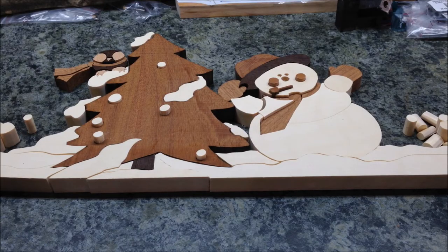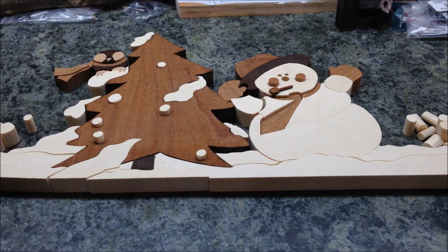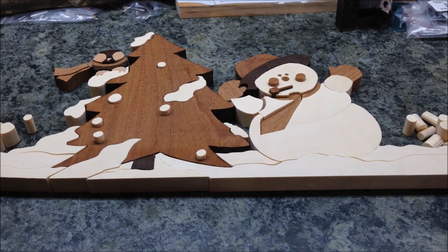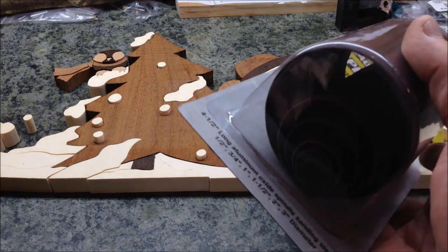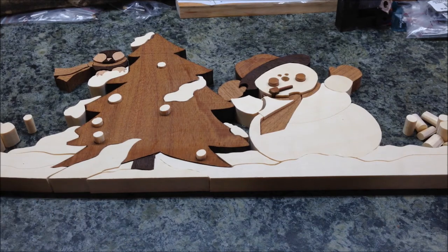I did a little shopping. I wasn't able to find a marking tool, which was a let-down, but there's not a whole lot to be marked. I did find a nice piece of oak and I'm going to cut that into the half-moon shape for the background of this intarsia. I also picked up a full set of 240-grit spindles for my spindle sander — it came with 60-grit — so I can use the 60-grit for hogging out heavier areas and the 240 to clean things up.